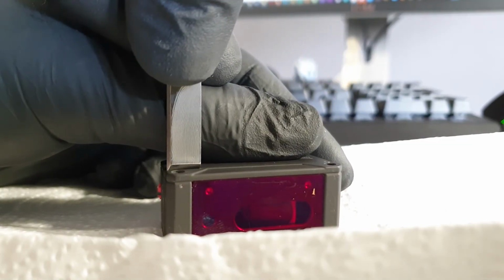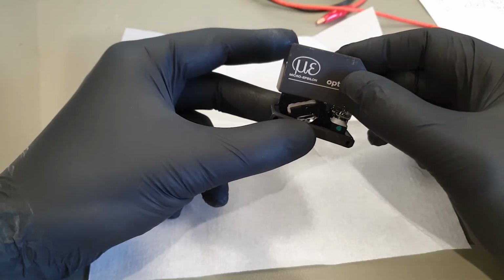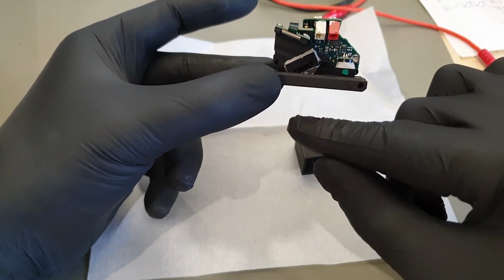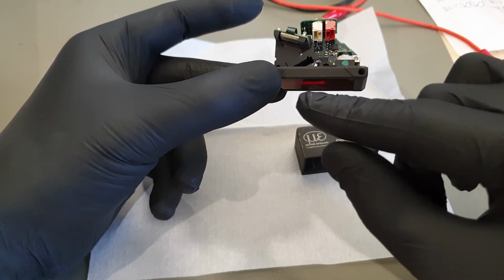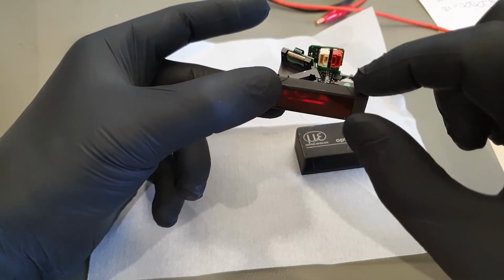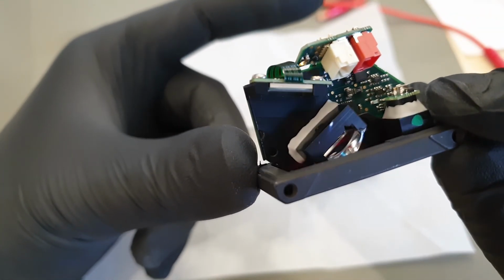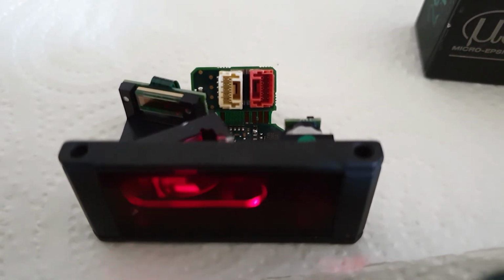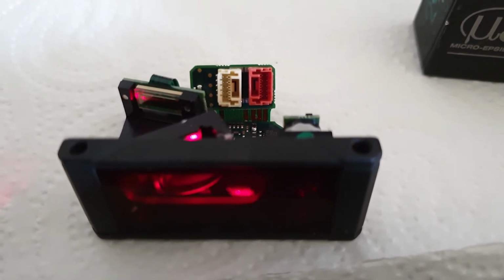Given its incredible specs and price tag, I would have expected this thing to be based on laser interferometry. But it's actually just a long image sensor onto which the reflection of the laser point is projected. That happens to be a very similar method to the one that's used in these Chinese LiDAR scanners. But I assume that for the sub-micrometer performance it needs to do error mapping. Maybe even thermal expansion compensation in software.